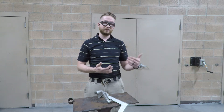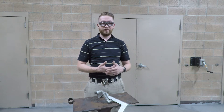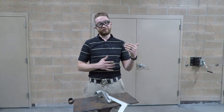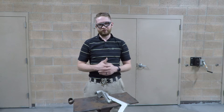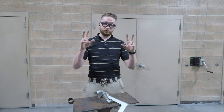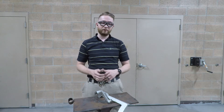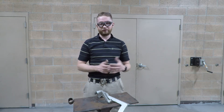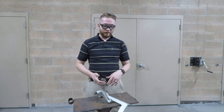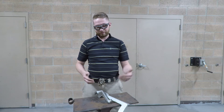I've been successful welding cast iron with regular 7018 electrodes, and also with MIG and TIG welding, but it generally comes down to a nice hot weld, super high overall temperature, and then letting it cool down nice and slow. There are other methods online using lower amperages — what's called cool welding — and using a hammer to peen the weld. That's actually where the ball-peen hammer comes from; you hit it with the hammer and it relieves some stress.